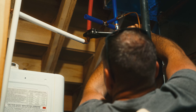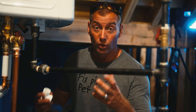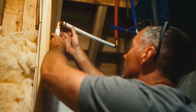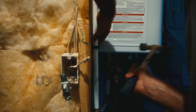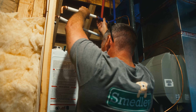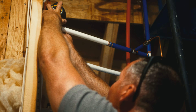Because it uses so much of its heat, it causes condensation within the appliance or within the flue piping. That's why the flue piping needs to be plastic — the temperature is low enough that it won't melt, and there's so much humidity in that exhaust piping it will actually condense and run water down the flue piping through the unit. So water running out the bottom of the unit while it's running doesn't mean it's leaking — it means we're at maximum efficiency, just like a high-efficiency furnace.